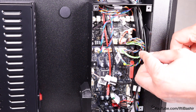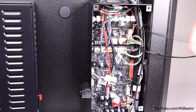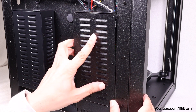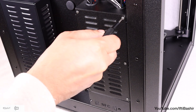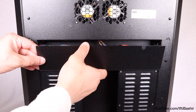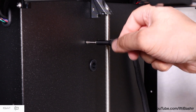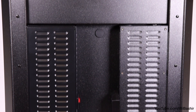Tidy the cables and secure using the two remaining zip ties — again no need to go super tight, just enough to hold the cables in place — then carefully snip the tails. Slide the metal electronics chassis cover into place, taking care not to pinch any cables, and secure with six M3x4 screws until snug. Finish the rear with the final metal cover for the top bunch of cables, lining them through the top tray, placing the cover into the recess, pushing forward and upward to engage with the rear panel, and securing from the front with two M3x4 screws. The rear of the printer and all main electronics are now complete.